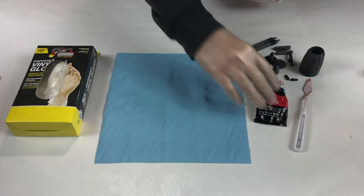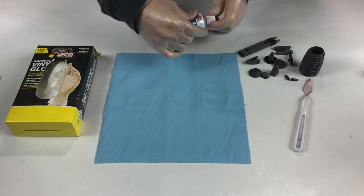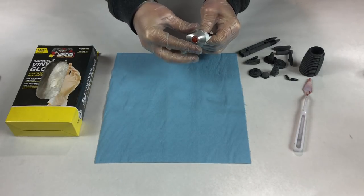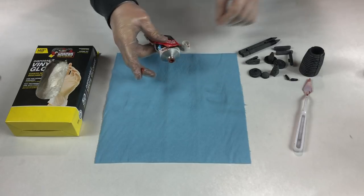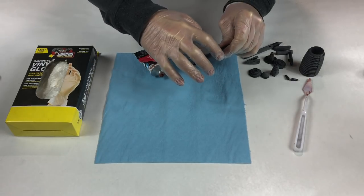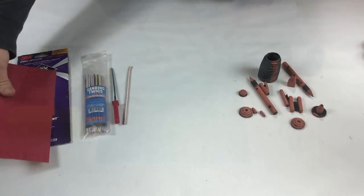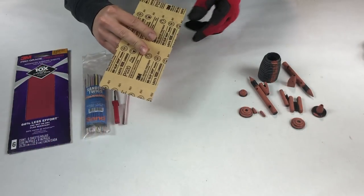There are a few ways to smooth out your 3D prints. The method that I use requires some effort, but the results are worth the time spent prepping PLA prints. Wear some latex or vinyl gloves to spread a layer of one-part filler putty over the 3D printed parts. Allow the putty to dry thoroughly, and then sand off the excess with 220 grit sandpaper.